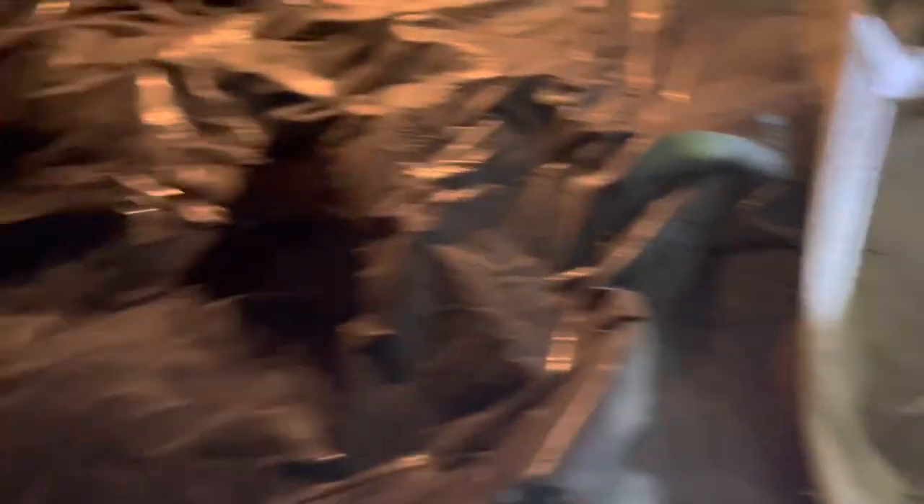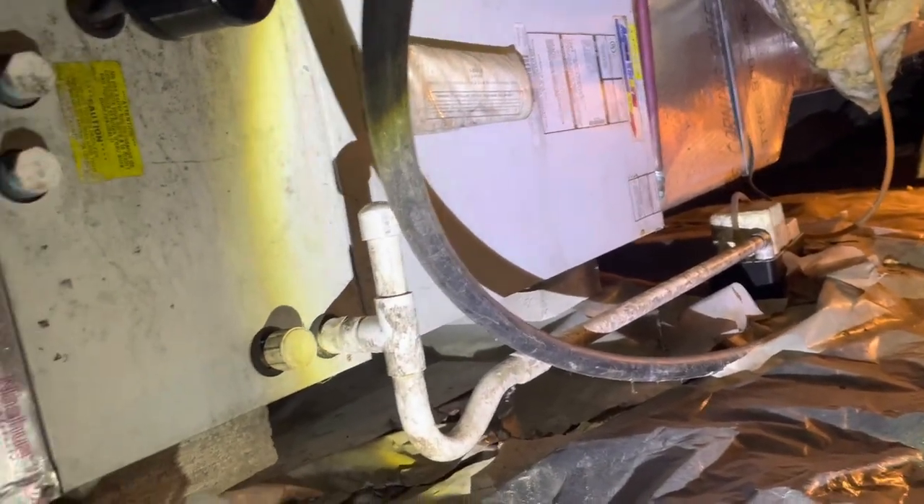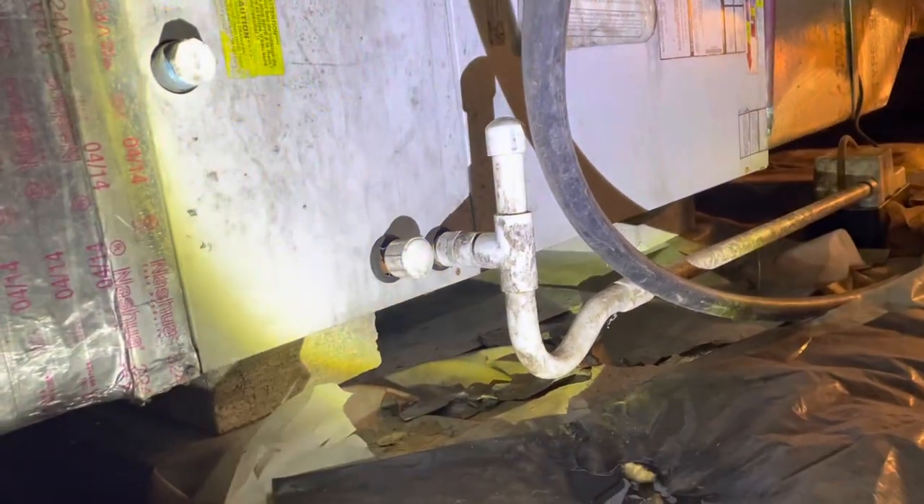Well, that's a welcoming sign going into the crawl space — snake skins, two of them. All right, we have an Aqua Therm air handler by First Company. This unit has a hot water coil and a refrigeration coil in it. We're going to mainly focus on the refrigeration coil to find this leak. I wonder if they replaced this air handler in 2014 when they replaced the outdoor unit. It is 410A. I'm not very good with First Company's serial numbers or date codes so I have no idea what the date code means.